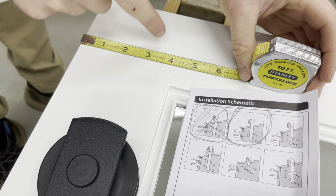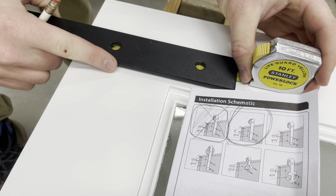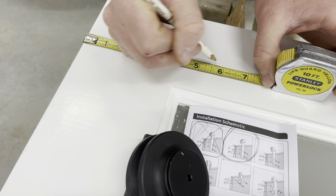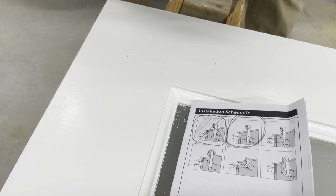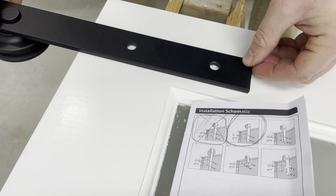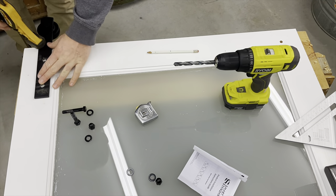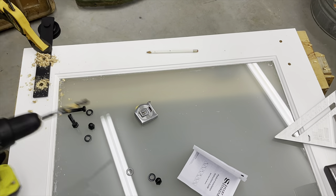I know I want the hinge on this side of the glass, so I'm going to try to measure it out evenly so I just have to do everything once. We'll measure down the first one 2 inches and then 5 and 9 sixteenths — make a little dot. You probably can't see this but I have a dot here and a dot here. Now that everything is marked out it's time to drill the holes. I used a 3/8 inch drill bit and this allowed the bolts to fit very snug. I clamped down the actual rail piece as a guide to help me drill exactly where I needed, and I had a backer board underneath the door to prevent blowout when the drill bit went through the other side.